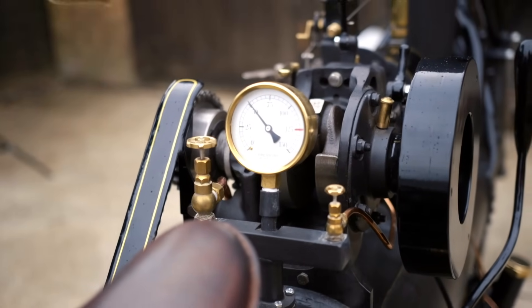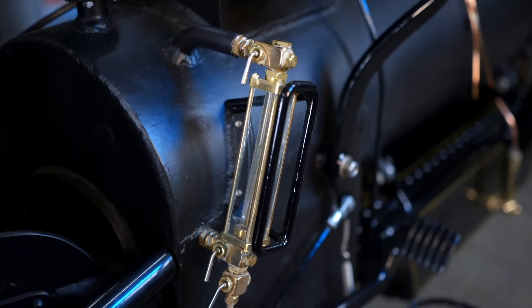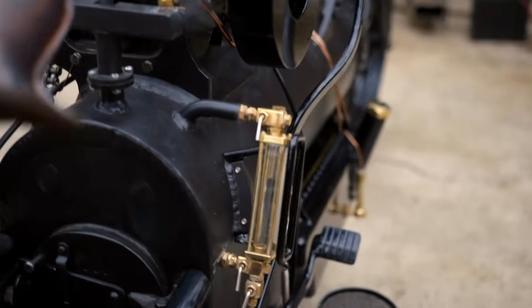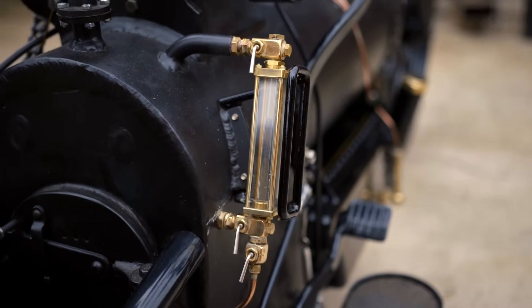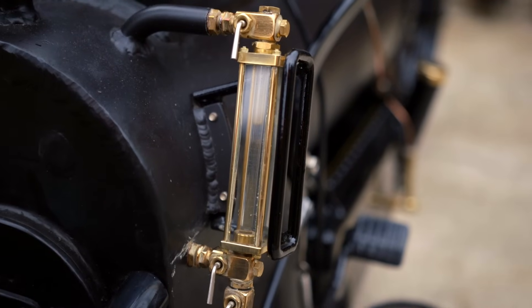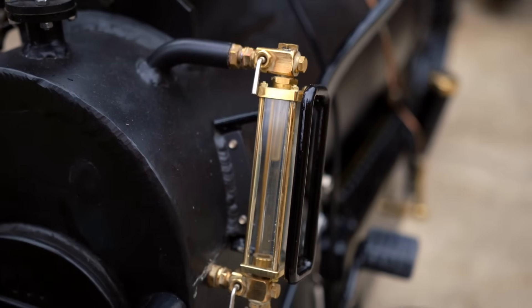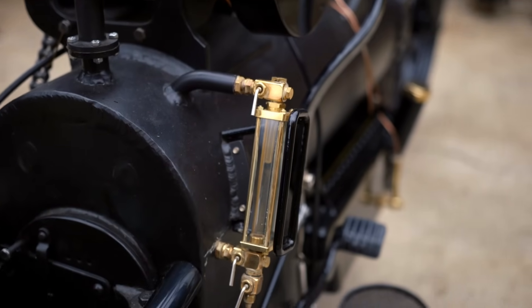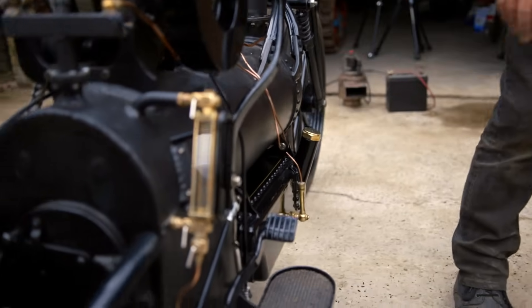So there we are, 50 PSI now — it's going up all the time. We've got a glass gauge on this side that seems to be bobbing up and down a little bit. That's the sight glass — they've all got sight glasses on engines, some have two as a matter of safety in case one fails. You always keep your eye on the sight glass. It's telling us the level of the water; at the moment it's up to here, so everything above is steam and below it is water.